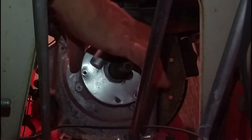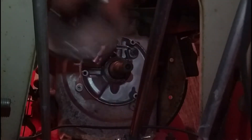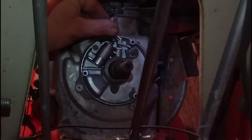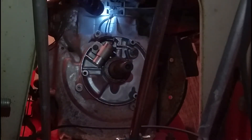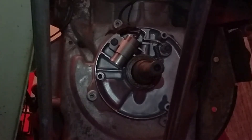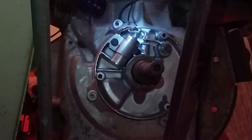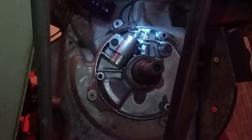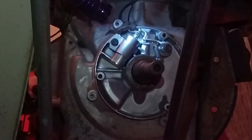These are the original points in this motor. You can see I'm breaking the seal where the ground wire goes in and connects to the condenser right there. Right now I'm just looking and inspecting to see any corrosion, any damage, any obvious defects. I'm spinning the motor around by the pulley on the front on the drive side, and I can see that the plunger and the points are operational.